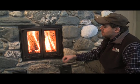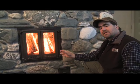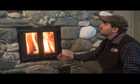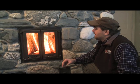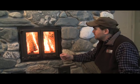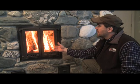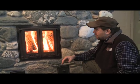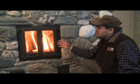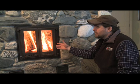And because of that clean burning nature, there isn't much maintenance that needs to happen to the heater over the course of the year or years. Generally on a daily basis or every couple days, the ash would be cleaned from the firebox and disposed of. And the fireplace really doesn't create any creosote. The main byproduct is fly ash.